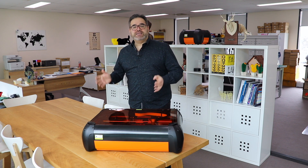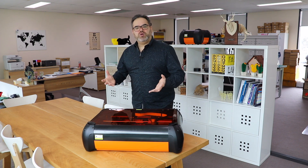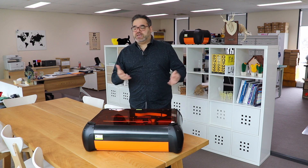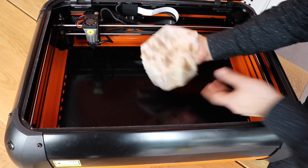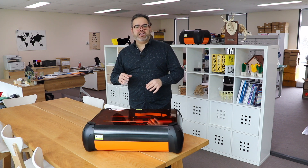The other thing I like to do is wipe down the internal body of the machine. A lot of people leave material inside, but using something small like a dust buster or handheld vacuum can take a lot of those larger particles straight away. I also like taking a wipe and wiping the inside of the machine — you'll be surprised how much material comes off. The machine actually atomizes the material into tiny particles you can't see. Wiping down the internal parts as well as the rails makes sure the machine can work at its optimum.